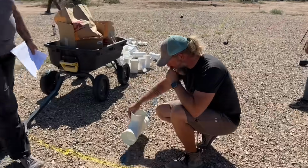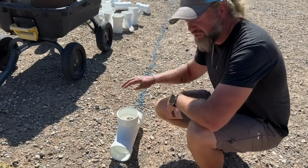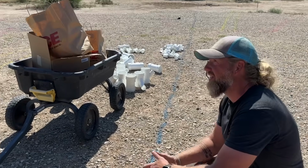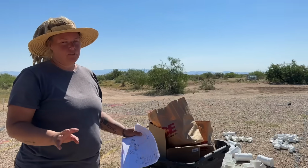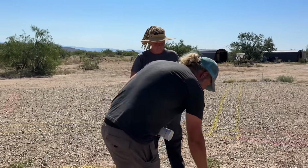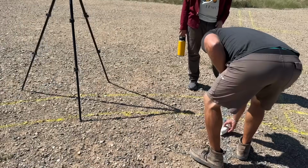Here on the outside of the wall in the courtyard, we'll do another two-way cleanout so that we can clean back that way and we can clean down this way. And then you want to go to the kitchen next? Sure. We are going overboard on our cleanouts just as preventative measures. So then you have... It's really accurate though. I know, we're going to have to work on that.